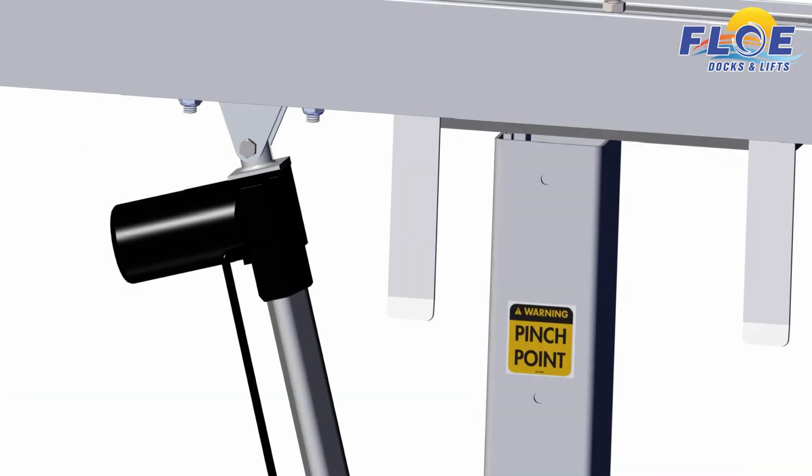From Chapter 5, you should still have a half-inch spacer sitting between the canopy rail guide bracket and the canopy leg. If it's not in place, put it in place now. This is done to ensure there is a 1/4 inch gap between the bracket and the leg. Although a 1/4 inch of space is needed for proper installation, a half-inch spacer is used to allow for sagging after the spacer is removed.